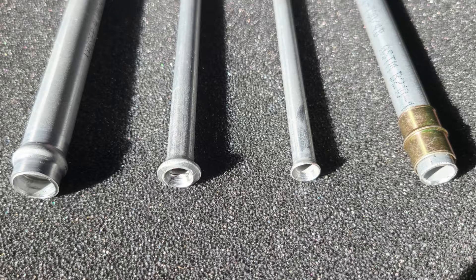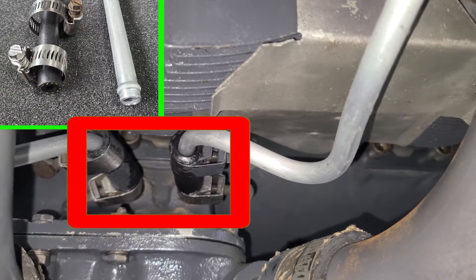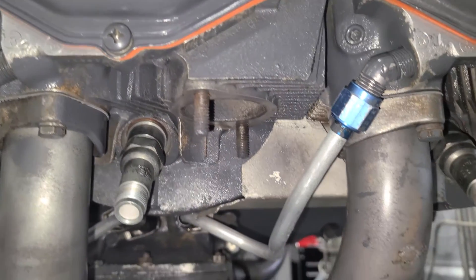The tube can be manufactured with a bead, with a double flare, a single flare, or flareless, depending on its application of use. The beaded type requires a bead and a section of hose and hose clamps. It is used only in low or medium pressure systems.